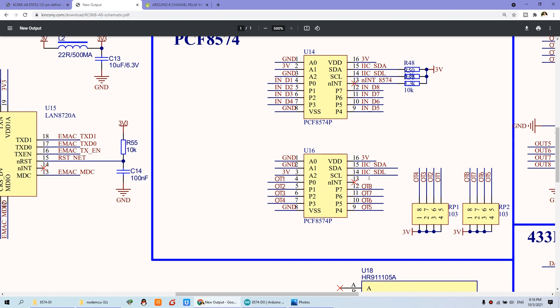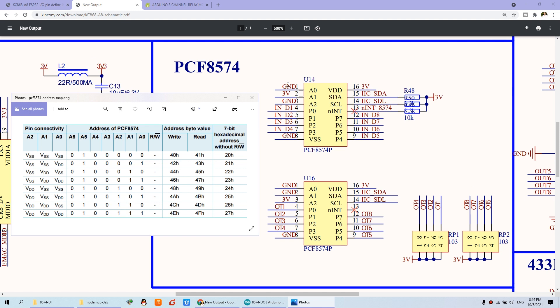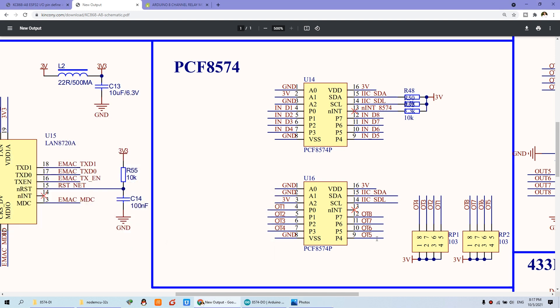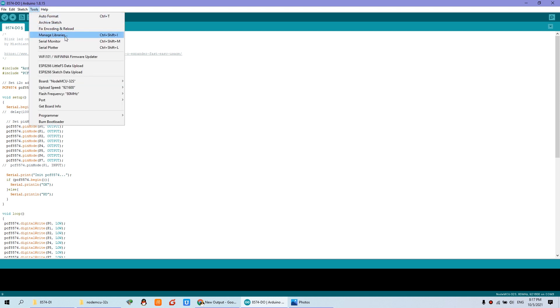In the next video I will tell you how to use the input part. The input chip has A0=0, A1=1, A2=0 — so that is binary 010, which gives address 22. In the Arduino code, you include Arduino.h and PCF8574.h. You need to install the PCF8574 library — you can do this through the online library manager.